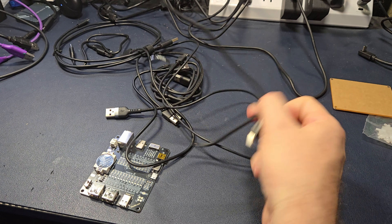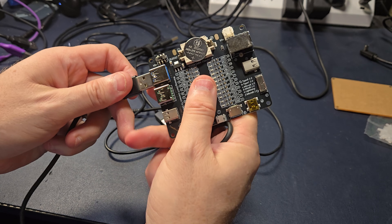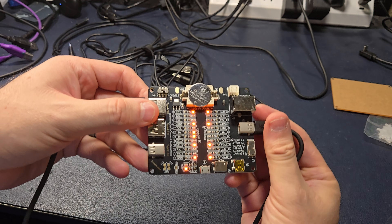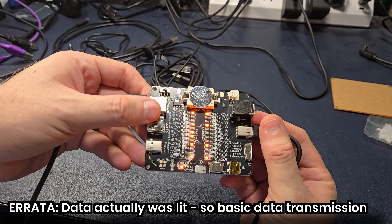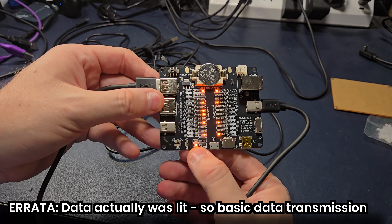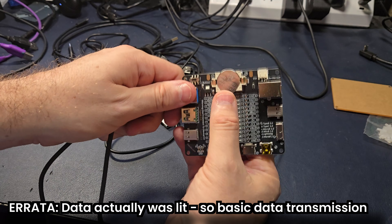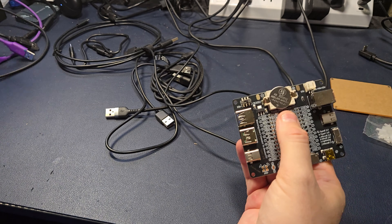Let's grab another one. This is USB-C, and I do have a USB-A in here. I don't have a plethora of these older cables hanging around anymore. We have V bus and ground, no transfers at all. This is literally just a power cable and that's it. The shield's good, ground is good, V bus is good — the cable is good, but it's only good for power.